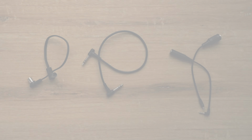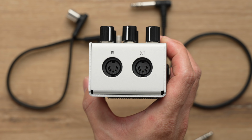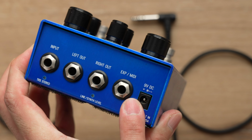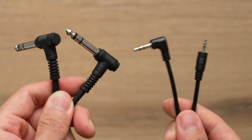There are just two of them. The two types of MIDI ports you will see on devices today are 5-pin ports and TRS stereo headphone type jacks. Just like with headphones, the TRS jacks for MIDI come in two sizes, 1/4 inch and 3.5mm. Other than the size difference, there is no difference between the two.